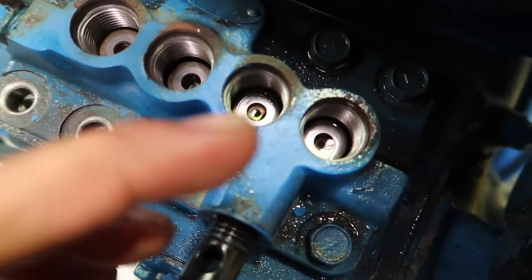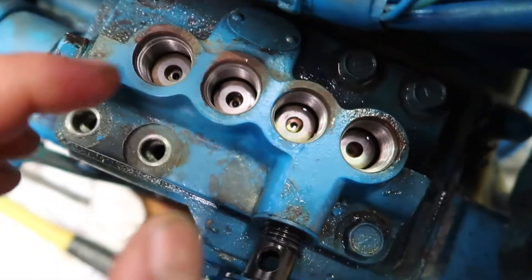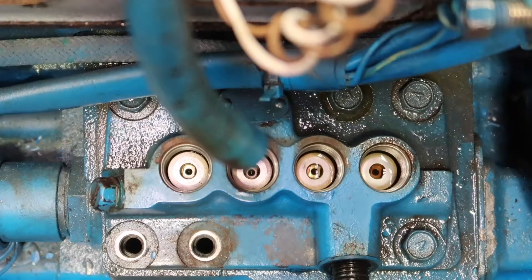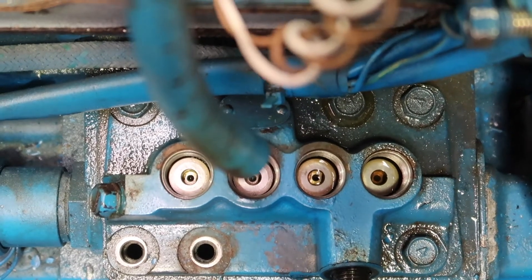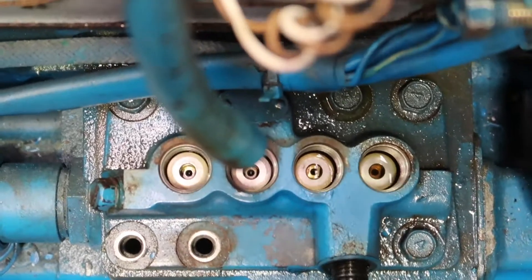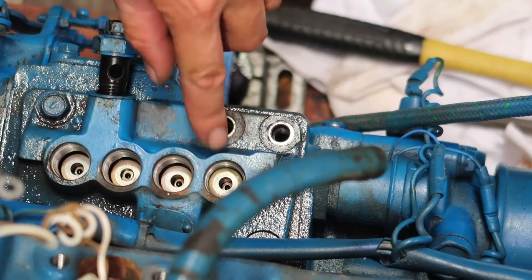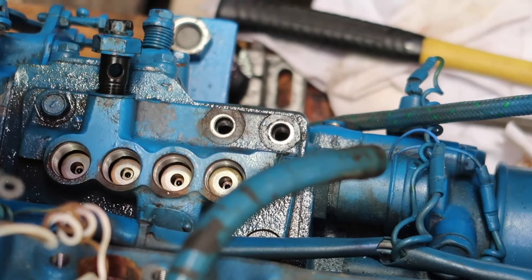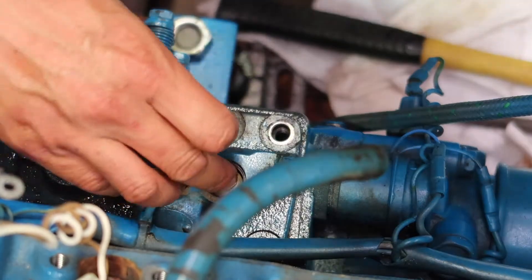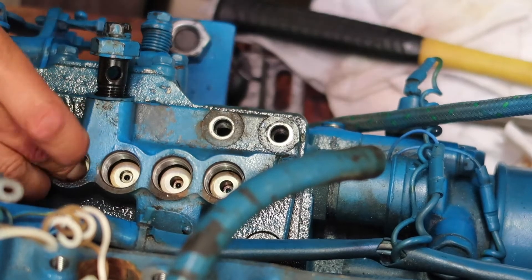So I'm hoping once I clear these up — I've been hitting it with a small hammer and a little punch — and that has freed up that cylinder there. I'll show you that now. As I spin this, you can see it went down, and then as I turn it comes back up. So that's moving now. So that's the first piston coming up — you can see that. Basically that sleeve is meant to be pushed down and the piston has reached pretty much the top of its stroke. So that one's come up and we've got to push it back down — that's where it's been a bit tight.